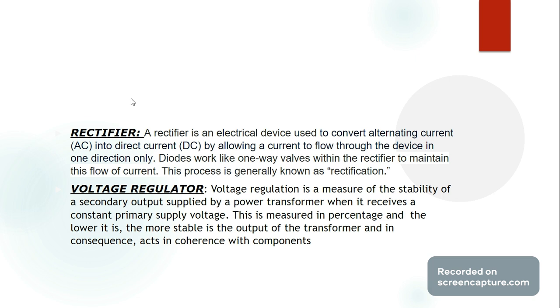And this adjustable voltage is made possible with the placement of resistors about each terminal, which then determines how much the regulator provides at its output. And its functioning is ensured by maintaining the voltage supplied to the regulator so that it is confined within the limits of the regulator. Otherwise, if it exceeds it, then the functionality of the component will deteriorate over time and eventually reach a point where it does not function.